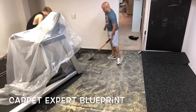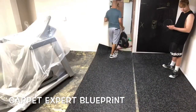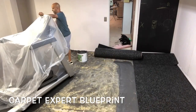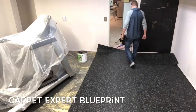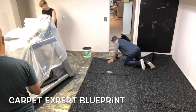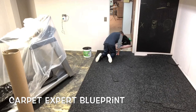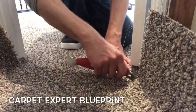We go ahead and put the next set down and then start to glue everything in. This is a process without a doubt, but very financially rewarding in this line of work. With rubber flooring installation, same scenario — it's very heavy material so you want to do a little section at a time. Slowly cut down on everything, get it all glued in so it doesn't shift around on you, and then trim it in just like you would do the sheet vinyl. If you have any questions about installing rubber floor, just hit me up and I'll be sure to answer those.